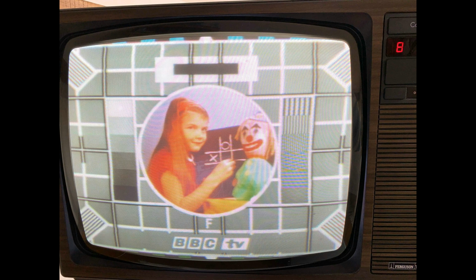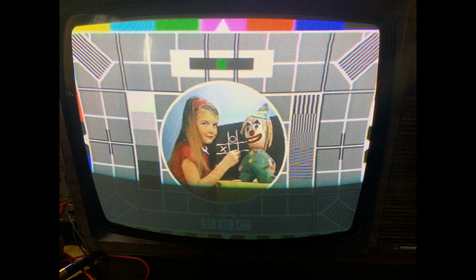So in today's video we're talking about the next stage of the TX10 resurrection. The picture that you can see on the screen at the moment, and the pictures that follow, are basically images that were taken before we managed to get the width working on this particular set. You can see that the grayscale is slightly pinky in places, that there are some wobbly verticals, and that the pincushion is really a little bit out.